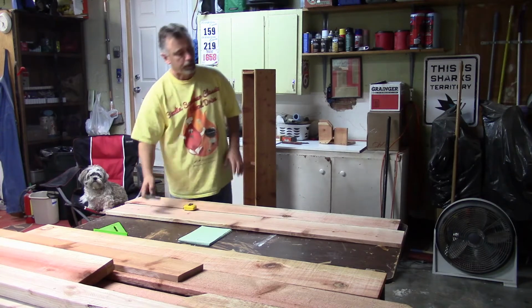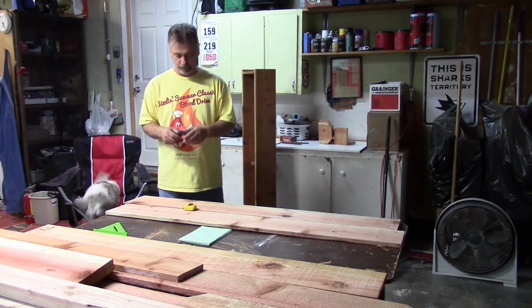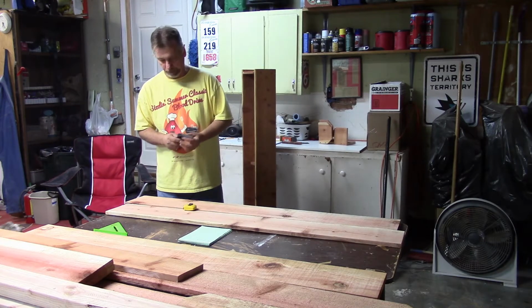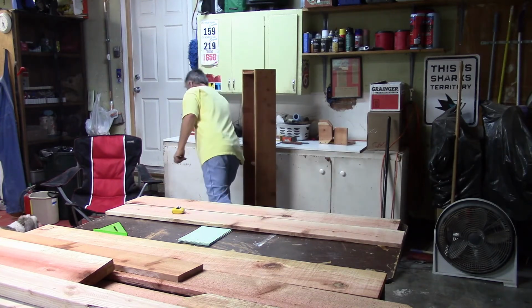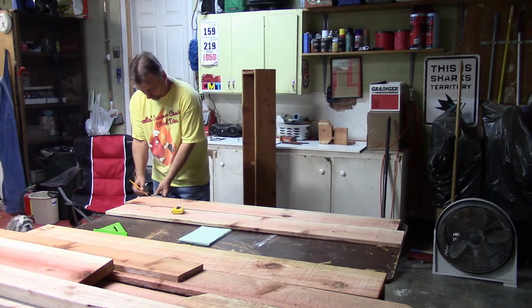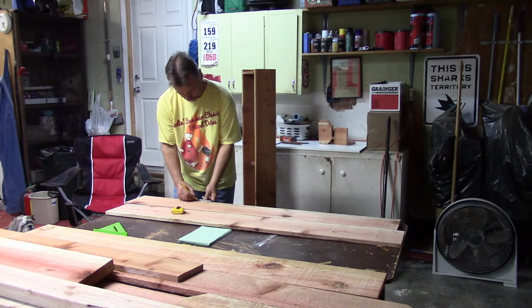Going up, check your wood. A lot of times the wood comes in different thicknesses. Mine, I'm going to do mine at 5/16 up. So, where'd my pencil go? I got it. Found it. So I marked them this way, and I'm going to go through and draw a line with my square, okay, up. And it gives me my holes there.